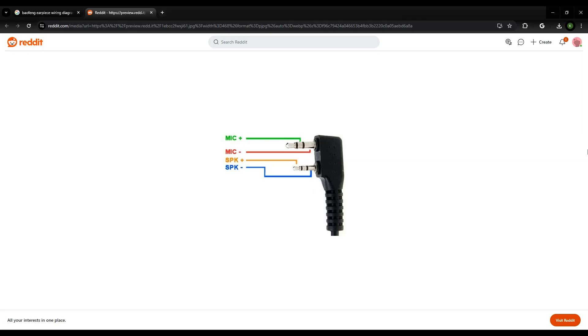You won't use the gold wire — it's uninsulated, so cut it and set it aside. All you do is take the green from one end and splice it to the blue at the other end, and conversely take the blue from the other end and splice it to the green. You're just crossing blue and green. Then red goes straight through to red. That's it — cross blue and green, red to red, discard gold.